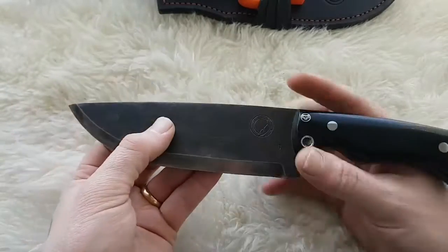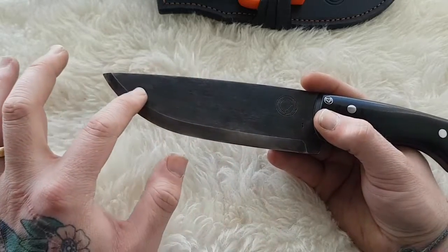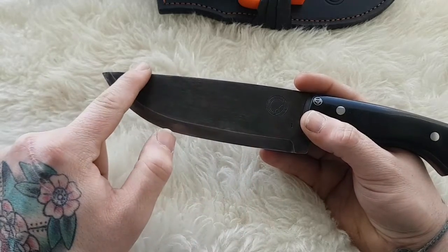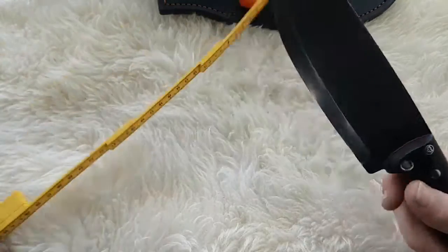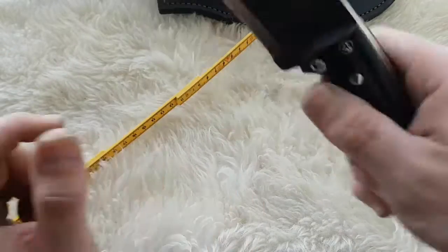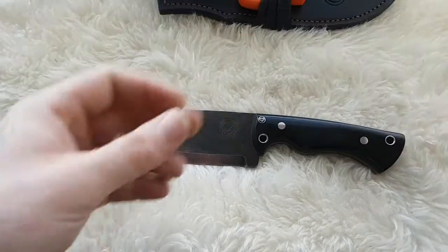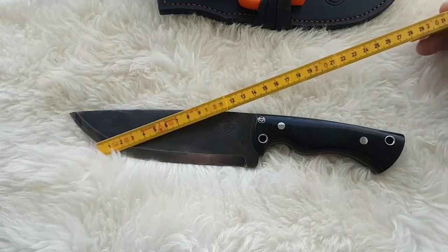Next was chopping, and we decided to go with the full sweep here rather than a sharp Puukko type sweep or a long hunter type sweep that you do see on some knives. Most of the chopping of a knife is done in the belly. So when the belly is narrow, you end up using this part here, and you're not getting the full effect of a blade, because the energy of a blade when chopping travels down through it like this in a kind of lateral motion.